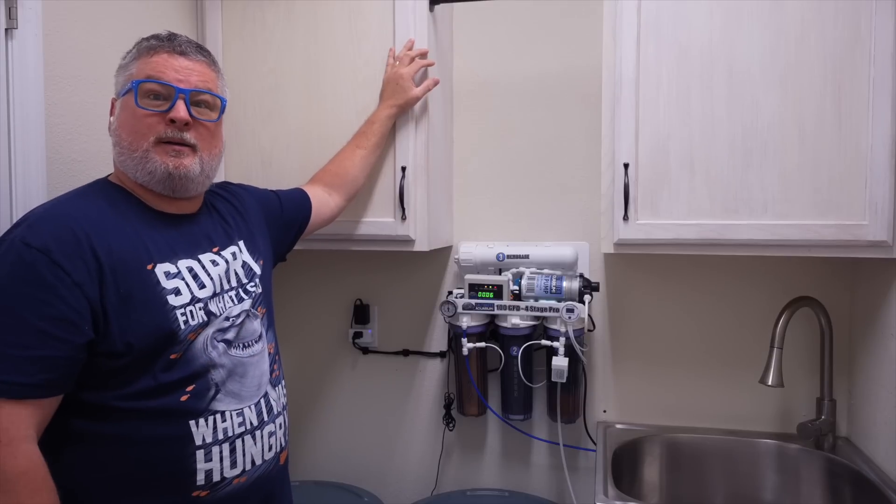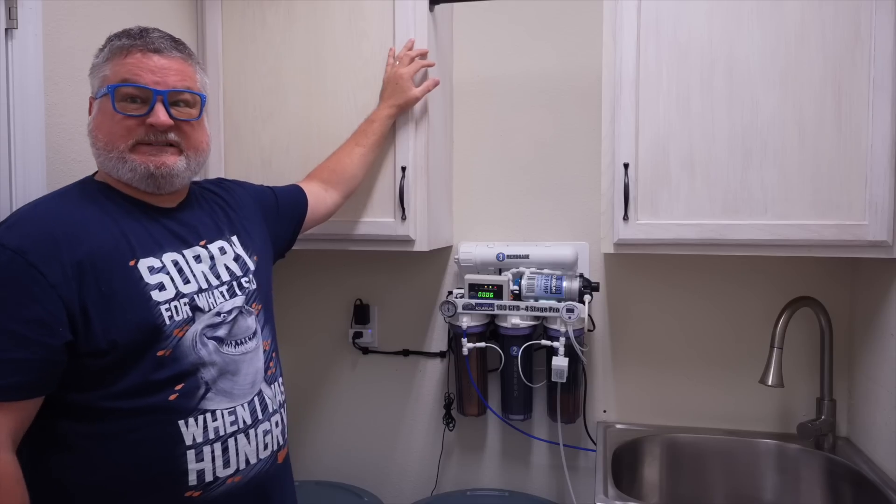That's about what I am. I've seen it as low as 20 in some places, and then as high as 800 for people who have really dirty hard water. So 100 is not bad — that's going to help your RODI unit's membranes and filters last longer. But the 40-ish numbers after the RO membrane and after the DI stage tell me your RO membrane is shot and your DI stage is shot.